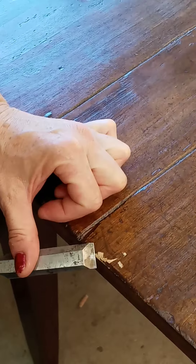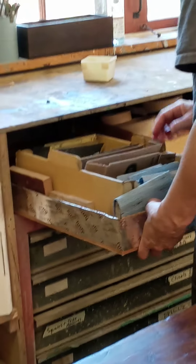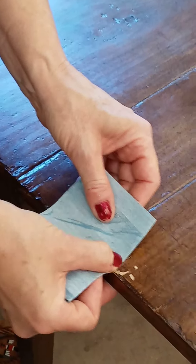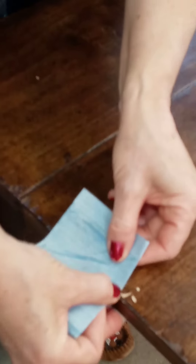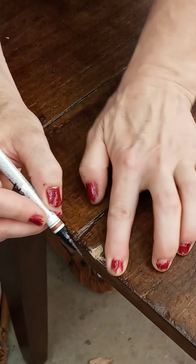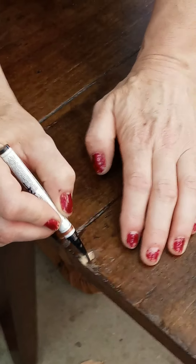Now for a defect that's a little bit rough around the edges and you feel like it will catch your finger — I'll make this a little deeper to show you — that's kind of a sharp edge right there. What I have to do is take fine sandpaper like 220 or 320 and carefully just sand right there where it's sharp. Now that's touchable, and then we'll come along with our perfect brown touch-up pen.